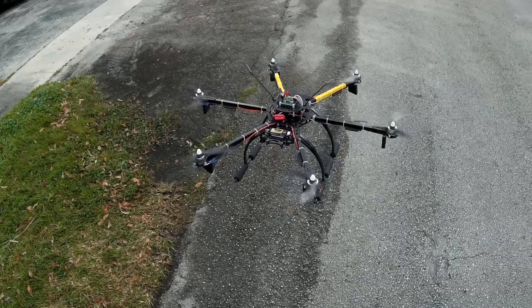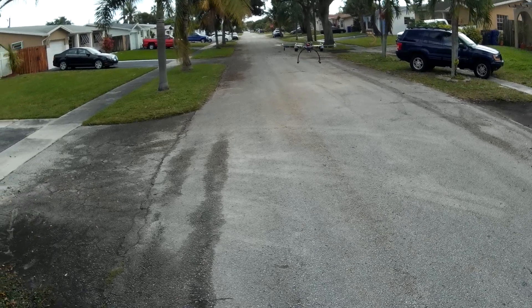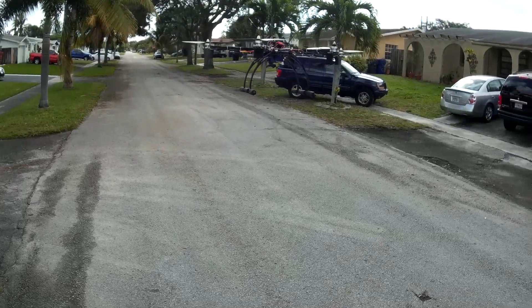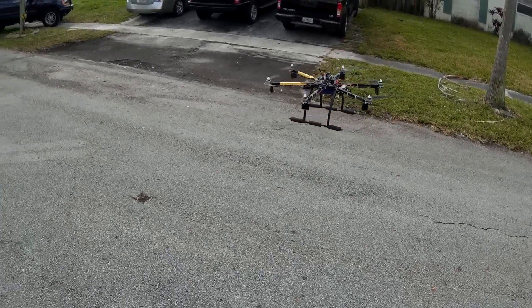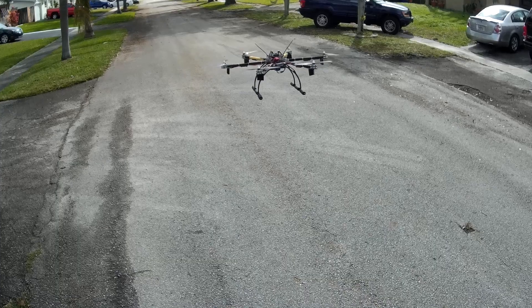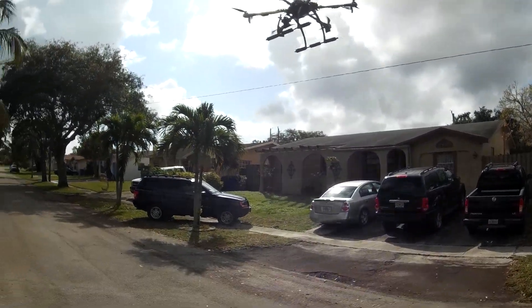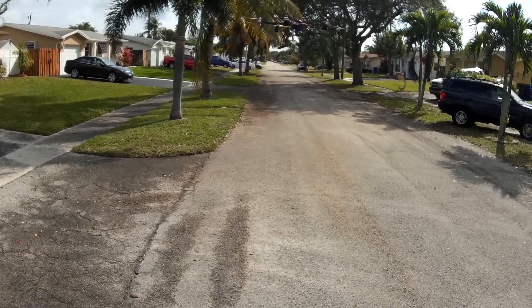The little beeper I have on there is the new one from Hobby King. It's a tester beeper and it has a pretty big LED that you can see from far away, which I kind of like. Another good feature is that you can control exactly where you want it to beep — if you don't want it to do 3.7, you can do 3.5 or in my case 3.55. As a first warning that one of the cells is under 3.55, it should beep again when the second cell hits 3.55, and then a non-stop beep means pretty much all cells are low. When it starts beeping non-stop, you got to bring it down.